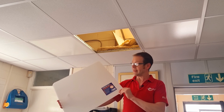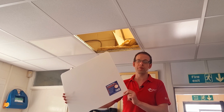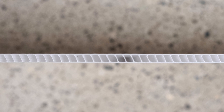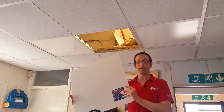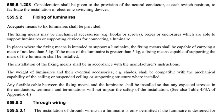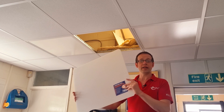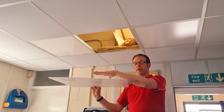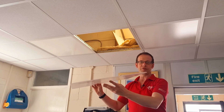So with all that in mind, Marshall Tufflex have created the Tufflex tile, and to be honest it's one of those things that you can't help but wonder why it hasn't been done before. It's just a sheet of material called Corex which has all of these square kind of hollow sections passing through it. This lends the material strength while keeping it really light. So strong in fact that it's been weight tested up to 5kg, which matches the requirement for fixing luminaires in regulation 559.5.2. Because it is so light it's easy to handle and move about site, and storage is really easy as well because it's so slimline. You can pile boxes of these on top of each other, but don't be tempted to stick them under other items in the van as that could lead to them getting damaged. If these internal ribs get crushed they'll lose their structural integrity and their strength as well.